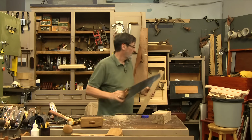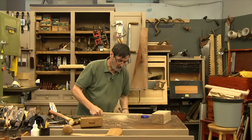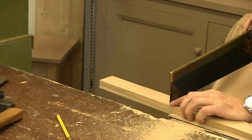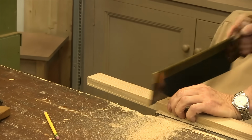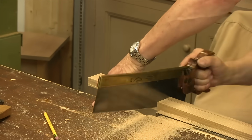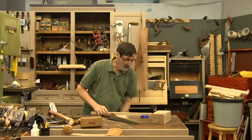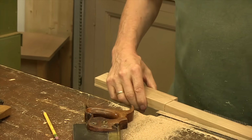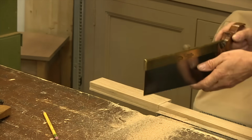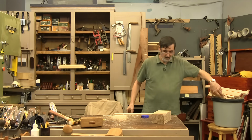And that's that. So I go to a crosscut saw now. I usually use a dovetail saw, something like that, a small tenon saw. This is a 14-inch, not exactly small. So I'm going dead to length here. Somebody asked me why the vise was away. I can put this in the vise like this, and I don't have to lose my hand when it grips here because I can keep holding it. And the other thing is I can come on this side here and hold the piece before it falls on the floor. Several reasons.